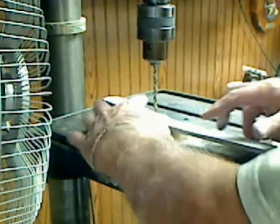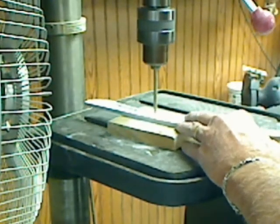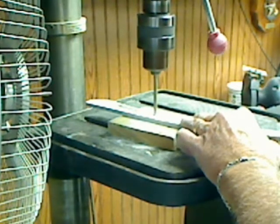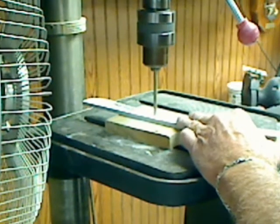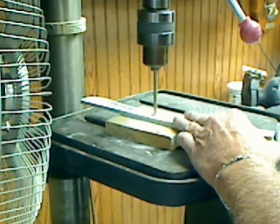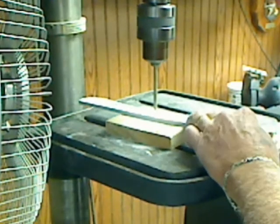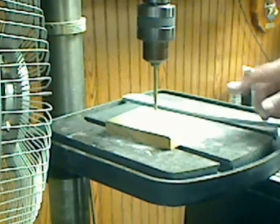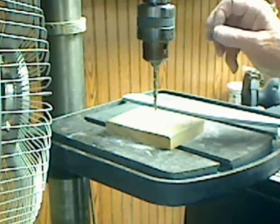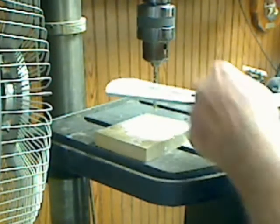You'll see I've got a fan going here to blow off the material as I'm drilling so I can see the lines. You can see how the fan clears all that material out so I can see exactly where I'm drilling. I picked the RPM up to 4,300 for a real high speed to use for the drill and for the carbide bit. I did a little practice run, and as soon as I get the rest of these drilled out, we'll put the carbide bit in and show you how that works.